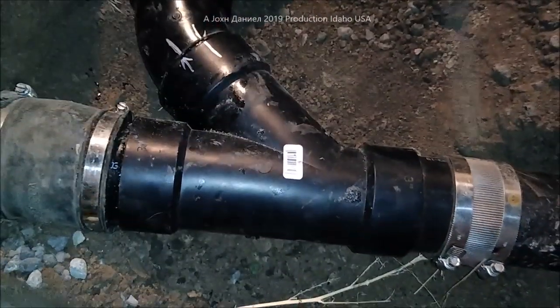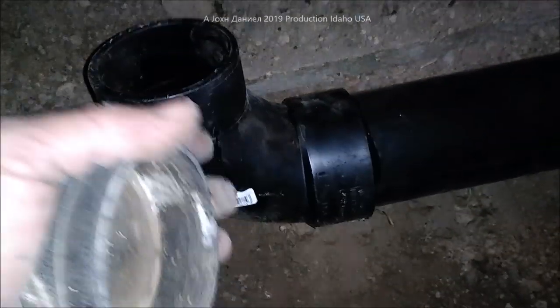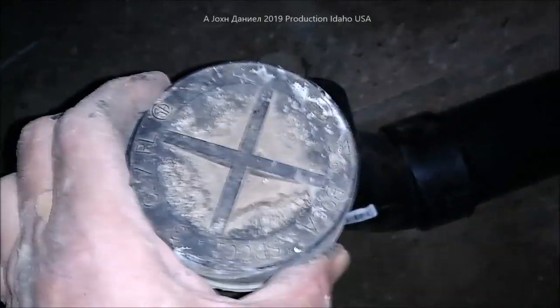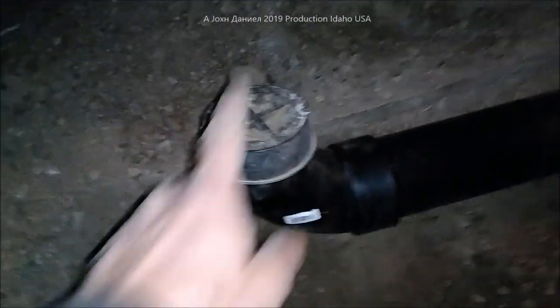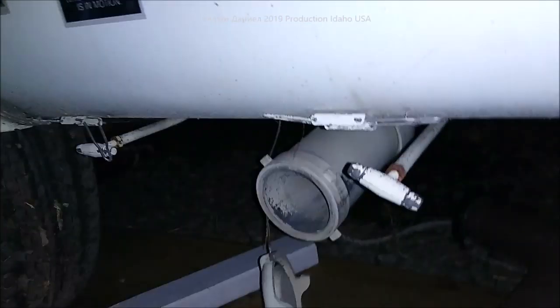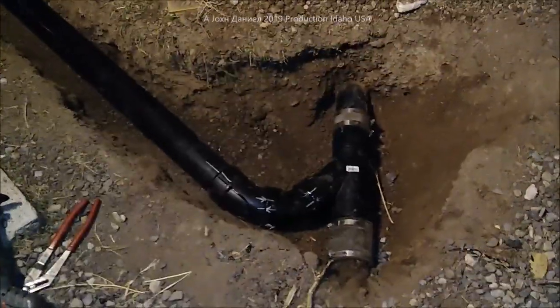This tool is designed for doing these kinds of couplings. What you've seen is the live tap installed before your eyes. I'll show you another feature here — we use a street fitting, which is a fitting that has a bell or hub on one end and a spigot or pipe size on the other. That allows you to use a standard test cap to cover your line when not in use. It fits snugly. In the ditch it's got a good eighth to quarter-inch fall and it's time to bury it and get it ready for sewer time. Pretty simple setup putting the old '76 Presidential into use — wasn't that fun, didn't take long.